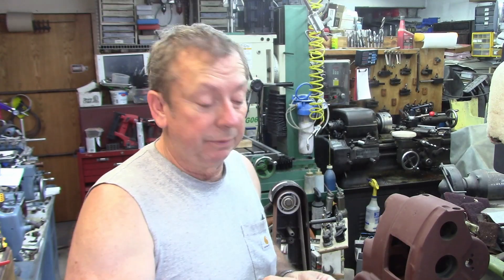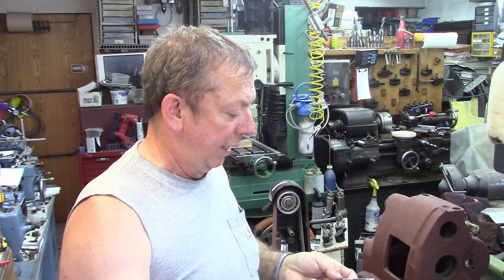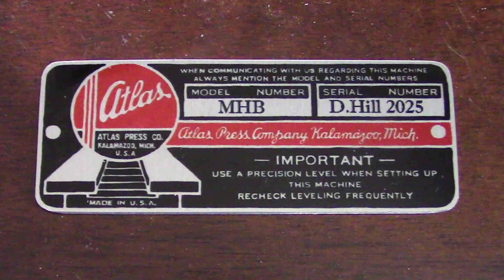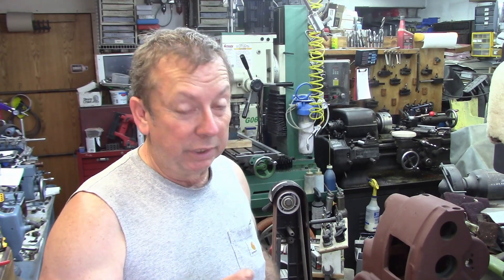I've got a couple of on/off switch labels printed that go on the mills and fit a couple of different machines. I've also got the label showing the model and serial number - it says Atlas Machine, Kalamazoo, Michigan - nearly ready to print, probably another three or four hours of editing. I plan to print the model and serial number right in rather than stamping, because stamping after sublimation cracks the coating on the metal. That happened when I stamped the ones for the Sheldon.